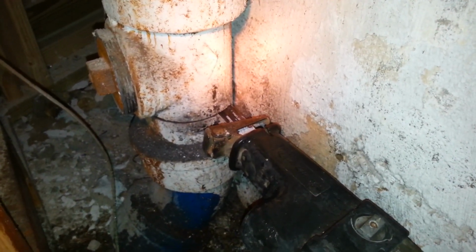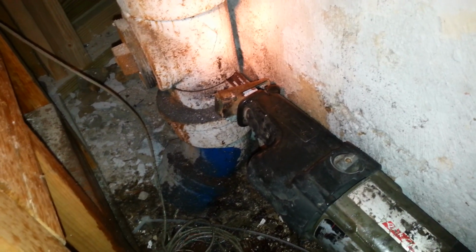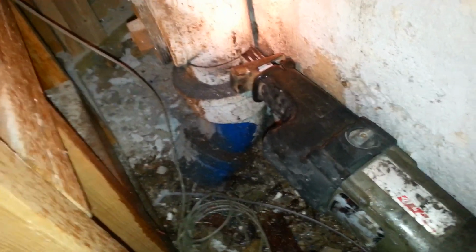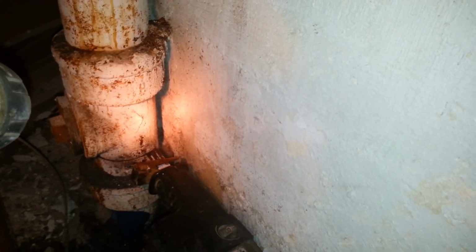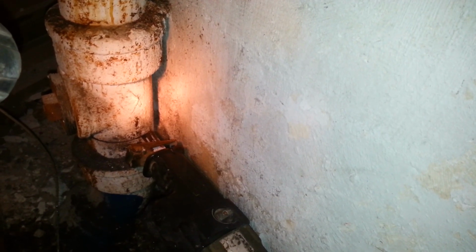But I've been cutting this. Probably took me a half hour to cut this far. It's not fully cut yet. It's just very slow and painstaking, and there's actually no working room. So I'm cutting it by hand because, one, the part that actually broke, that necessitated this whole repair, was a fitting. So I'm a little apprehensive of another fitting being able to handle the cut. Even though the pipe's in good condition, the fittings may not be. So I'm cutting this by hand, plus I can't get the cutter in there anyway, so I have no choice but to cut it by hand. So then we'll refit it up, and I feel much better about this, cutting this dandy out and replacing it with another fitting than just leaving it.